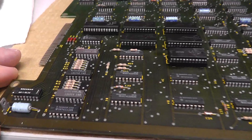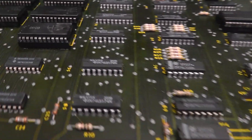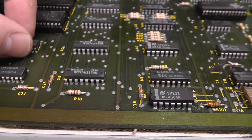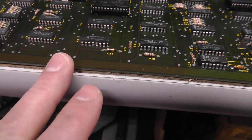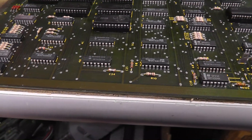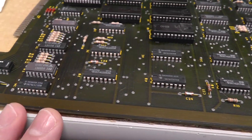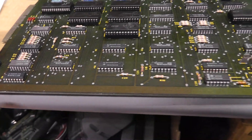All the chips are back in and it's definitely much better. The toilet bowl cleaner on this chip here really cleaned it up - I can almost see copper. I mean it removed all the oxidation and rust, so some of these were really bad. Even looking at the crystal. One thing I noticed is the discoloration - I thought the two boards' silkscreen was different, but this one is brownish here as well. I'm wondering if this is heat or sun changing the color, because it's one color of green here and then it gets more brown. I wonder if it was exposed to more sunlight than the other board.